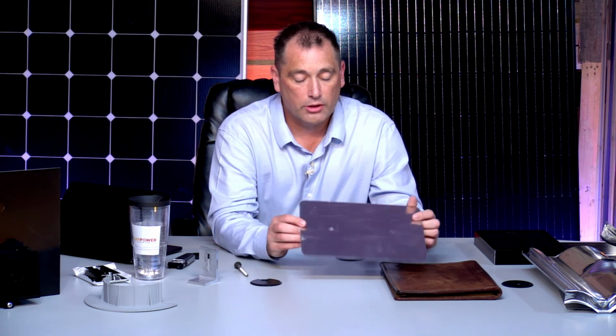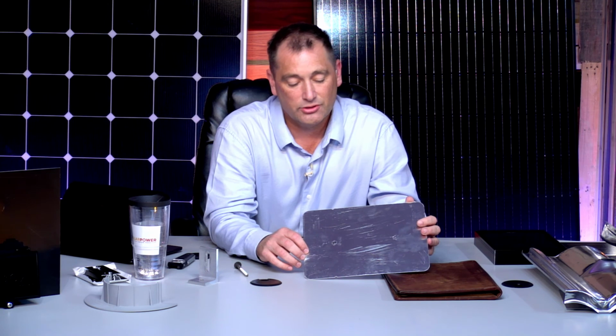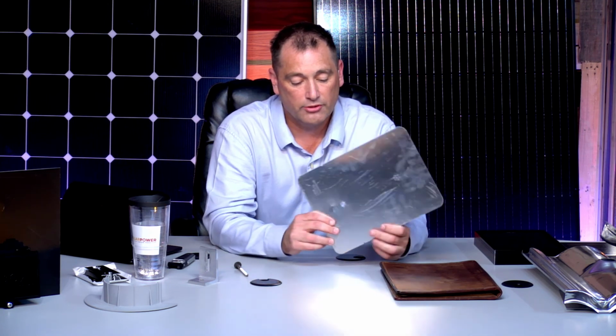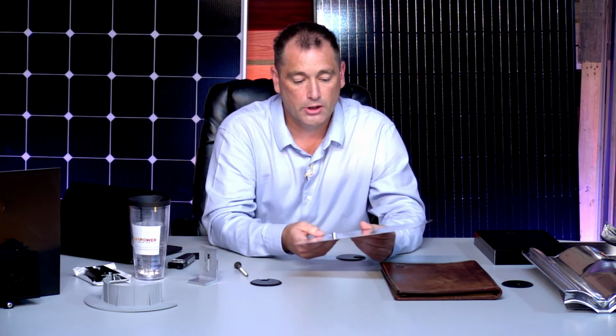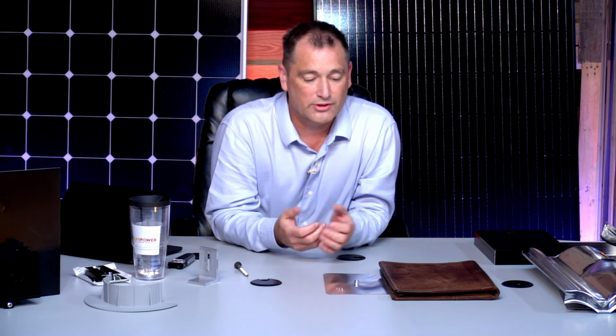So to do so, around this hole, we put a full circle of sealant around it. It's not totally necessary. Actually, some manufacturers just say put a U shape around it. We actually put a full bead around it. That bead is not going to set, and it's not going to adhere to something that's wet. So if they don't have these flashings down, I don't let my installers move forward. They will not be able to set this down because now you're sitting on a wet surface. It's just not going to seat. So I'm not a big fan of that.